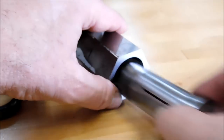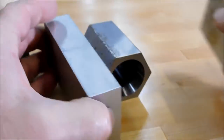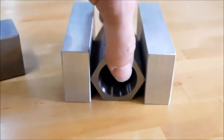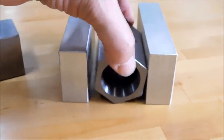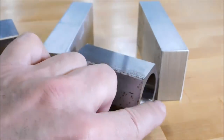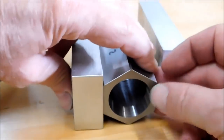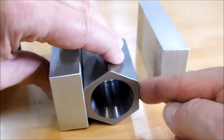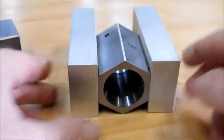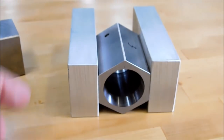I'm going to go out on a limb here and say: if you're going to use the hex block, don't squeeze it in your vise this way. I am not a big fan of anything that, if it were to dislodge, instantly becomes loose. Know your equipment — put it on a surface plate, put a pin in here, check the height, check everything, make sure it's all centered, and then put it up against an angle plate and check it again. That way you know when you squeeze it in your vise, it's registering on these ribs, and you know these ribs are precision ground to the center of your block.